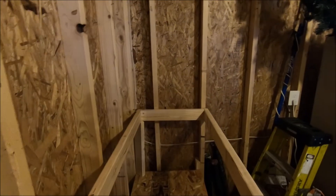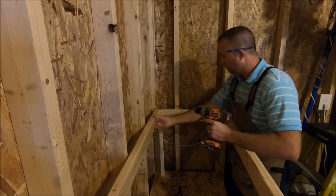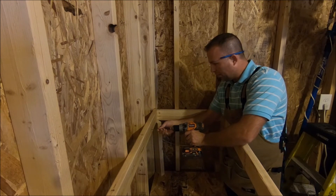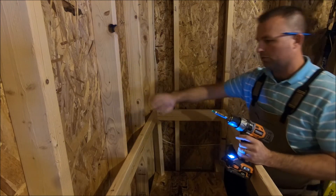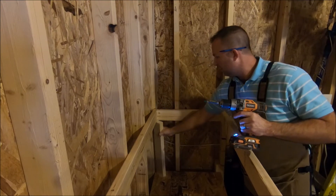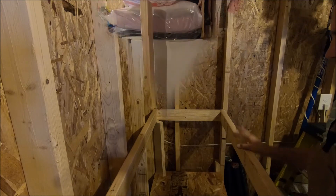So if you want to turn around, I'll show you this corner — let's screw this corner in right here. I have all the studs here, I just screw right into the studs and that holds my back corner in. You can see I have the brace here. So just once we're done, we pull the brace out and put it on the next level. I'm going to keep screwing these into the studs, we'll get the plywood on here, and I'll show you how we do that.